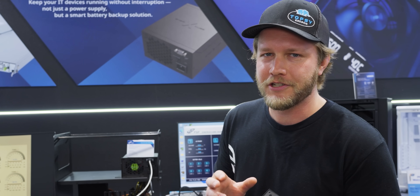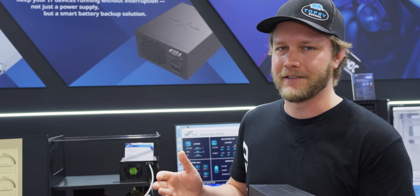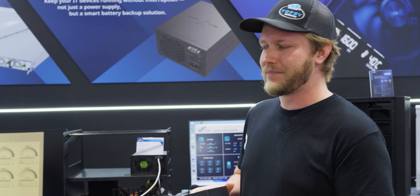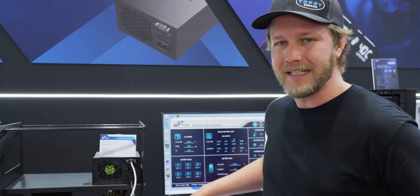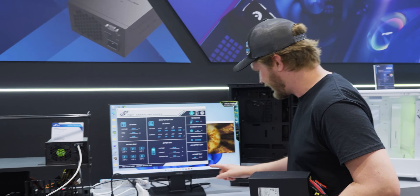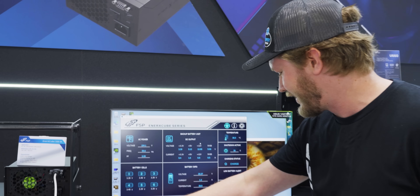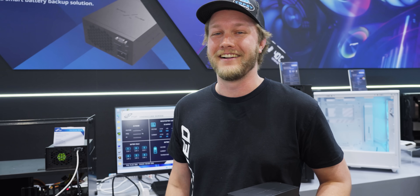Another thing worth mentioning is that the brownout tests in our power supply testing for PSU circuit have been a shockingly lethal test — that is simply turning on and off your AC power really quick, and it has killed three power supplies in our testing. Whereas this one right here, you can see the outage tally is currently at 129. Can we make it go up? Now it's at 130 — it could not care less.